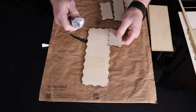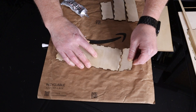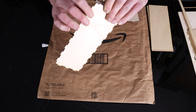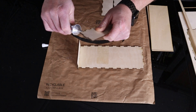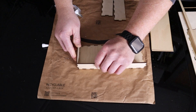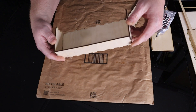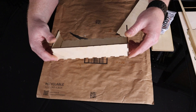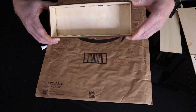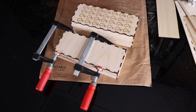Make sure to do this in an area where you don't mind dust. Now I'm going to put some glue on the joints — it doesn't need glue everywhere, just on the parts that will make contact with the opposite piece. The bottom has a pretty good tight fit, which is good. I'll do one of the long sides next to keep stability. In certain weather and humidity, pieces can start bending a little, so it might be useful to clamp them into a flat position. I got one side together and just have to do the other side. I have both top and bottom glued up — I need some small clamps for the top. I got a little messy with the glue so I'll clean it up with a razor blade after they're done, and then they'll be ready for finish.